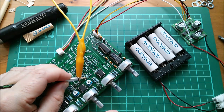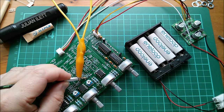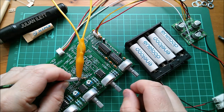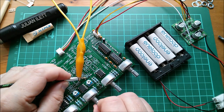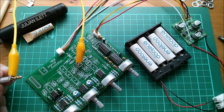The frequency control is here — that's the maximum frequency and it goes down very low, so it's just a clicking really. There's a shape facility which you can hear as a phasing effect. It'd be nice to get the second oscillator working because then you could get two-note chords and noise from the pseudo-random noise generator. The pitch seems to be drifting over time, but yeah that all works. My noise generator works — that's the important thing. That sounds good.